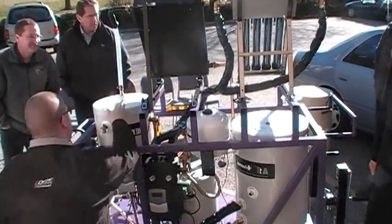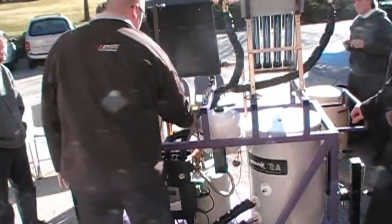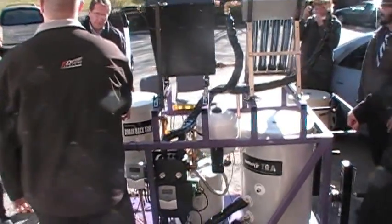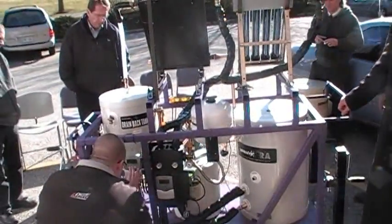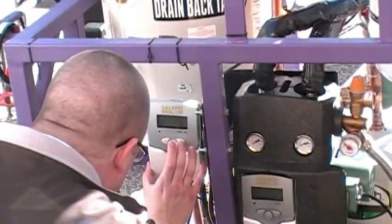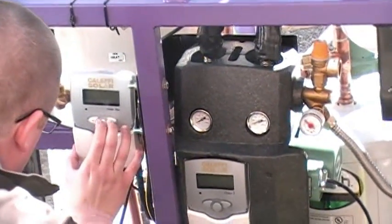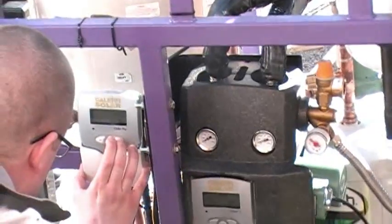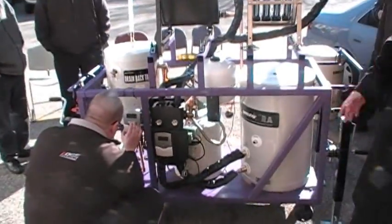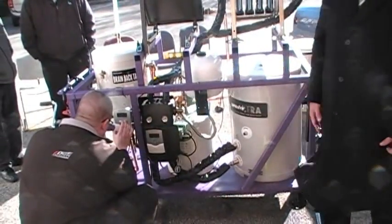This system over here controls the drain back, like Billy was saying. It controls this pump that circulates the distilled water, which is what we're using as the medium to transfer the heat to the potable water. Right now the collector's saying it's 111, and the tank is at 48. You have to remember that's because the potable water is only in a coil in that tank, so the rest of the water is whatever the temperature was out here this morning. Since the hot water heater barely got plugged in, we probably don't even have water going through that coil yet.